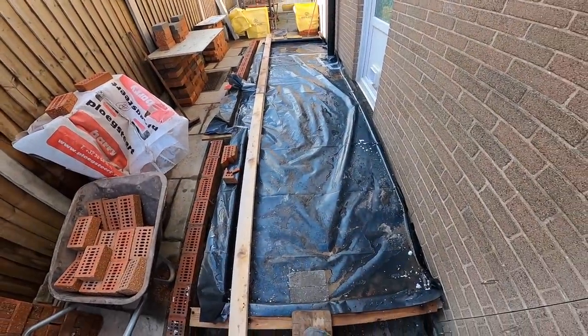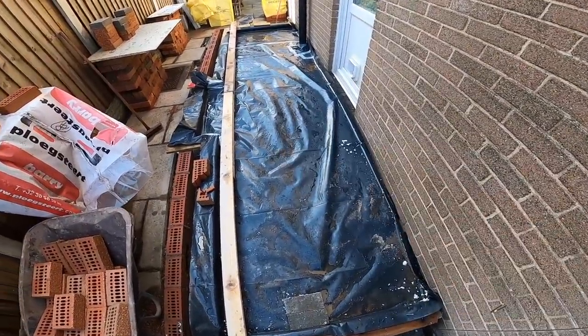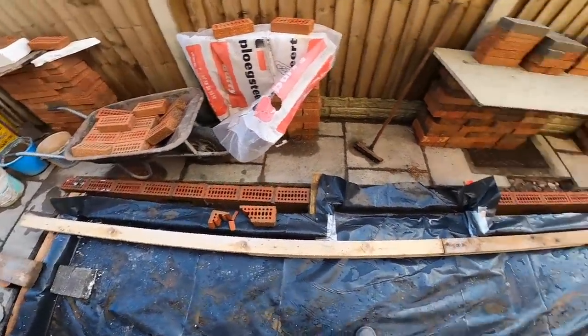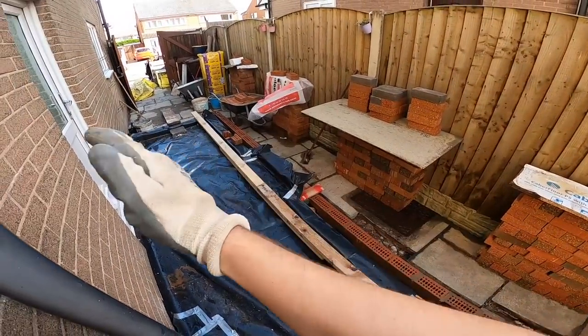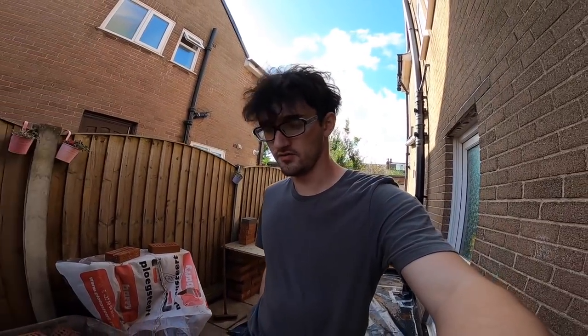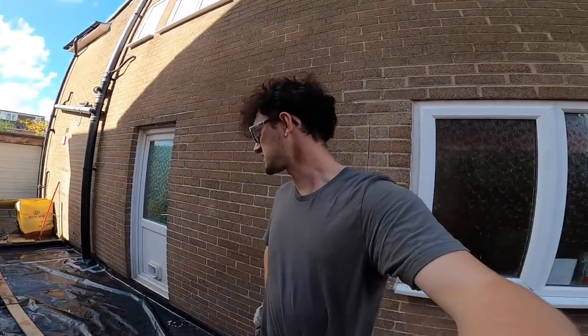I've drained out as much water as I could. It's all in the buckets, so recycling. So that's cleared out as best as it can be. Ramp set up for the barrows. Our tamp is ready, about 5.5 meters, so easy enough for us to latch on each side and tamp it out. So yeah, I think that's all we need. So just a sense of waiting for them now. Excellent, better than 4 o'clock, which is what we were dreading. But yeah, get you set up so you can watch the concrete go in.